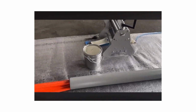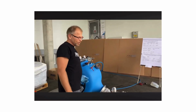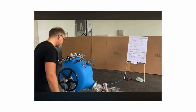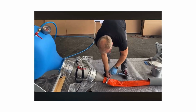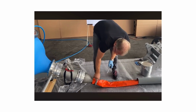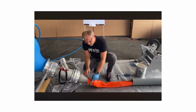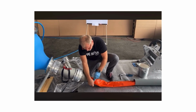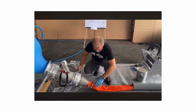That is open end line. You could hear it was blowing up by himself. Now he is laying in the pipe without any pressure. Afterwards, we install now the calibration hose. We have around about 1 hour pot life, so it is enough time to work, concentrate without any stress, without any hectic.